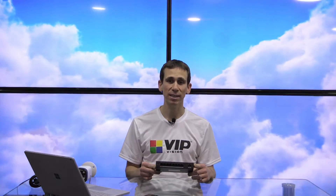Hi, it's Geoff here for VIP Vision. In this video we're going to be taking a brief look at the VIP Vision SWA series 8-port power over Ethernet networking switch. This is a standard networking switch which supports power over Ethernet via 802.3AF and 802.3AT specifications, so it supplies 48 volts.